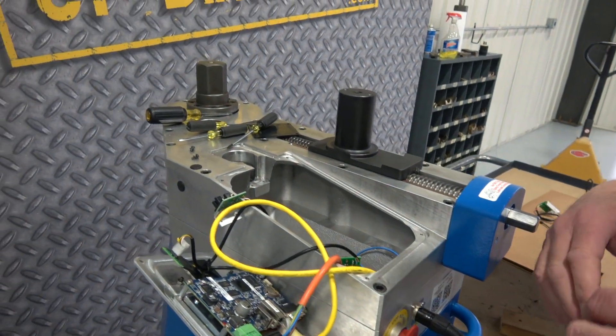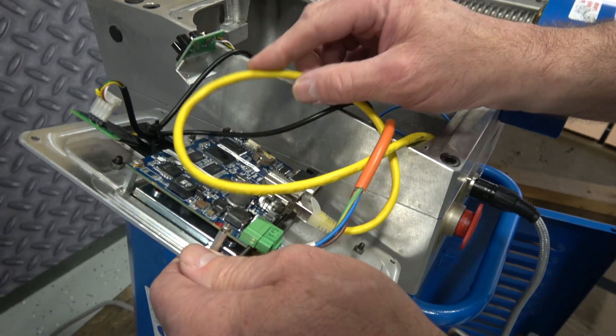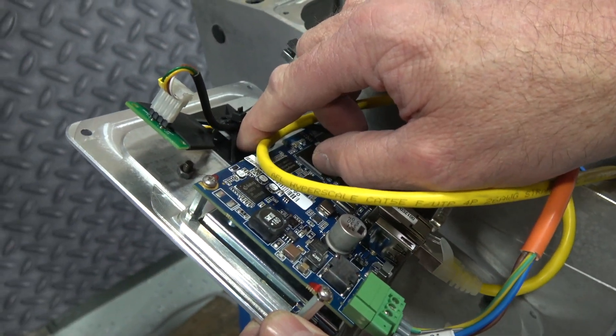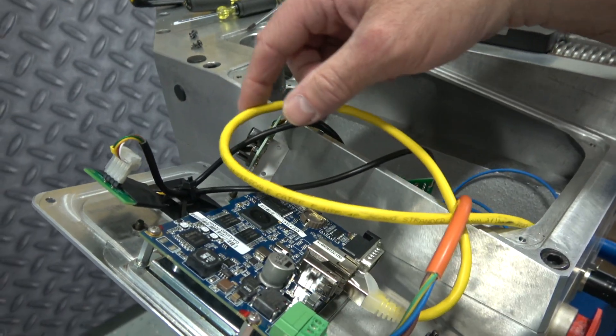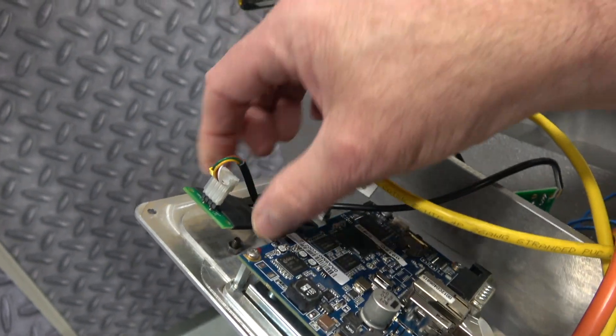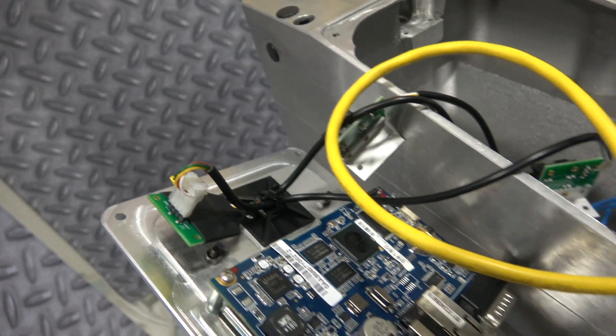For the sake of time, I've already done that and ran the cable through. I've also mounted the mounting square for the new encoder on the back of the top panel, because the wire harness is relatively short and we don't want to pull on it from the C encoder. So the jumper board goes through the board, through the panel, through the machine, and onto the DIN rail.